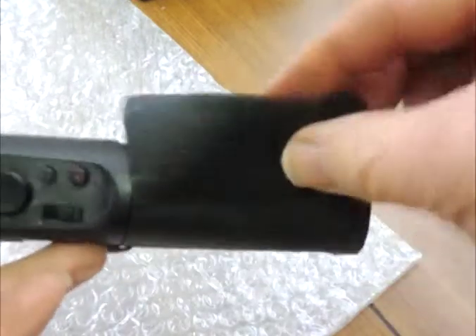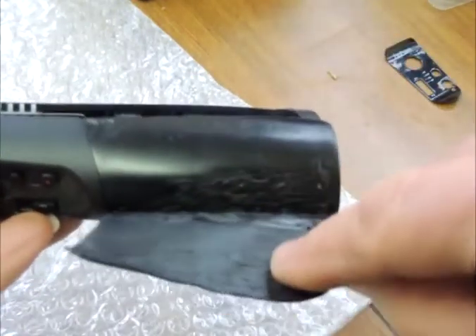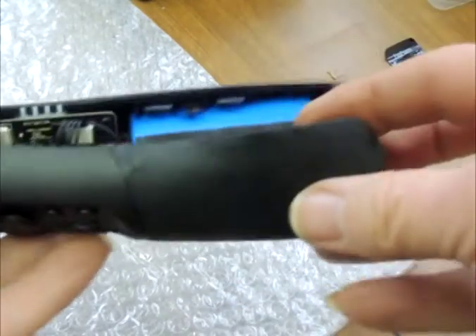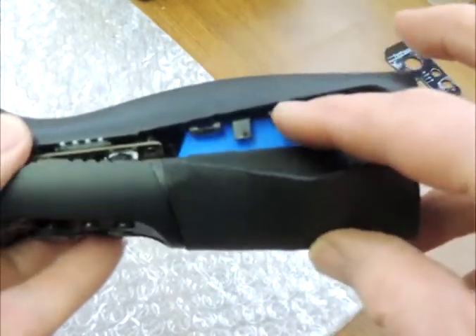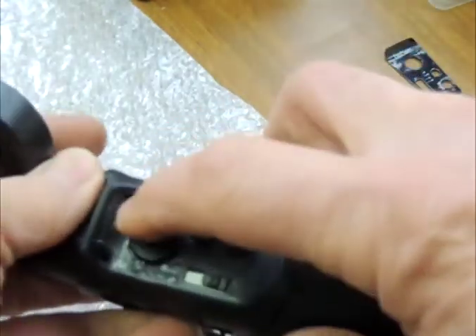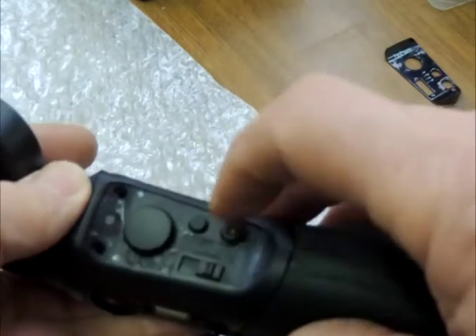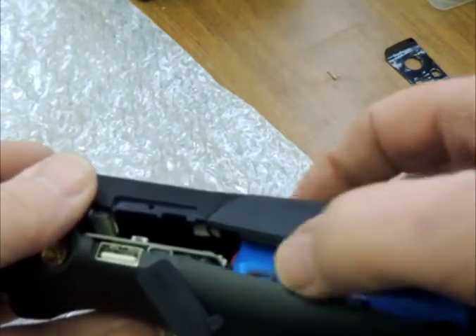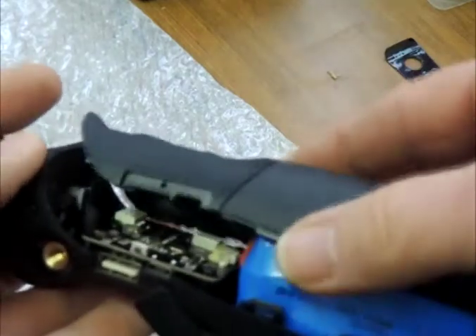Just thought of something — I actually started to unpeel the rubber handle thinking there'd be a couple of fixing screws under here. There isn't. It just relies on snap catch types to hold it together. So having undone those two screws at the front, I've been taking the escutcheon trim off, then prised it apart, and the whole thing just comes apart.